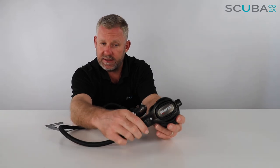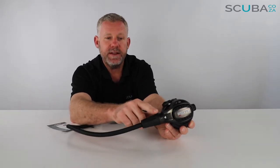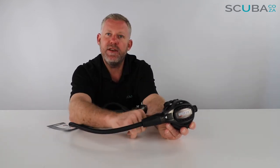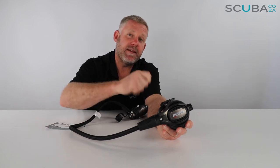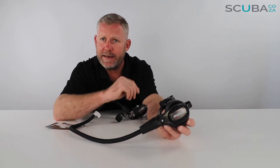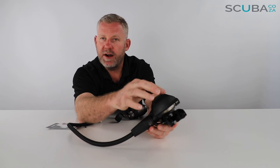Because of the VAD it also has what we call an assisted VAD. You've got a standard VAD — this little clip here — for normal air delivery, and it also has a pneumatically assisted VAD, which is a mechanical valve on the inside that when turned on will assist in giving you air. So you'll have a balanced second stage that can dial up to give air, as well as this mechanically assisted valve which allows a lot more air into the regulator. If you're doing super deep dives with the VAD turned on and the dial turned up, you're going to have a super low work of breathing — a very friendly regulator that gives you lots of air whenever you need it.